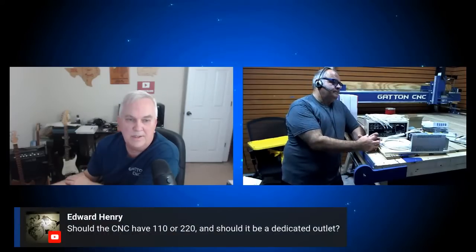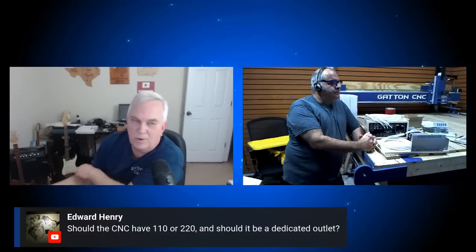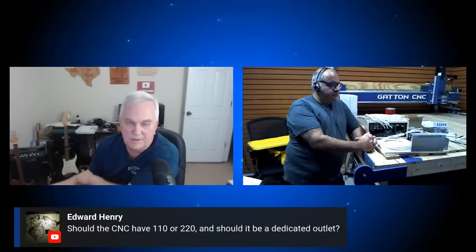Okay. Henry says, should a CNC have 110 or 220, and should it be a dedicated outlet? You're only going to need 220 if you're running a spindle that requires 220. The hobby box or any kind of controller box is going to use 110. And again, if you want it to be 220, let me know. I have to completely change some of the components to be 220. To add on to what Dave said, your spindle is often 220, unless you've got a 110 spindle, but the box itself is always 110 most of the time.